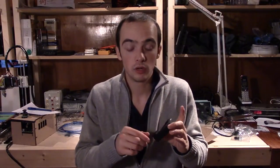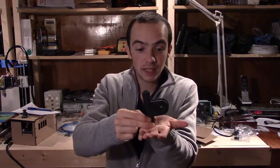I changed it so that I could print with no overhangs. Other changes also, like expanding the holes a bit so that the carriage bolt or the tightening nuts will fit into place. And finally, another really big consideration you have to keep in mind is which orientation you are going to print this in. Ideally, I want to print it in a single piece, okay? And so I figured that printing it like this and then just extending those downward would make it nice to print in one piece.